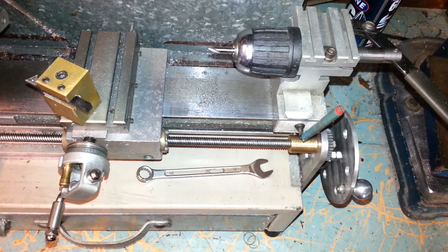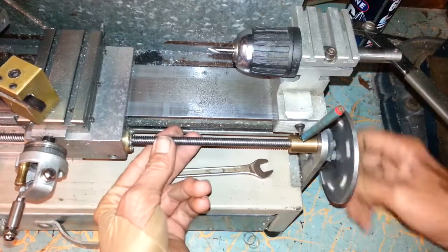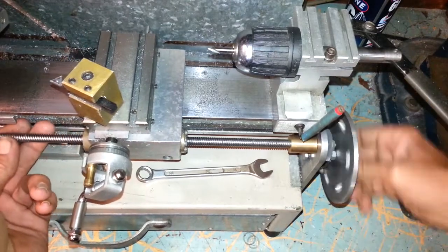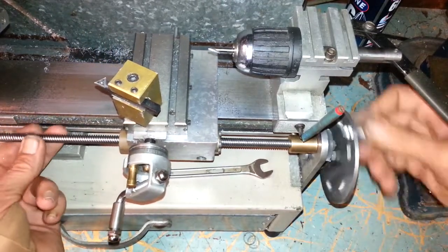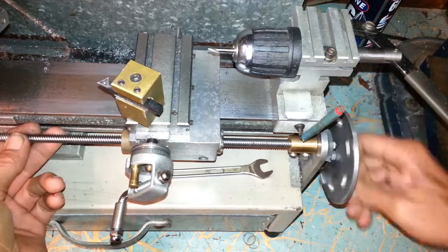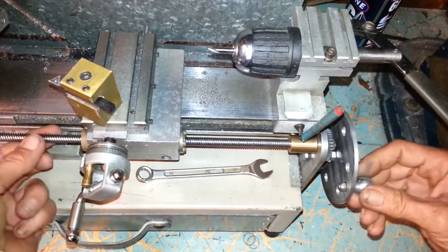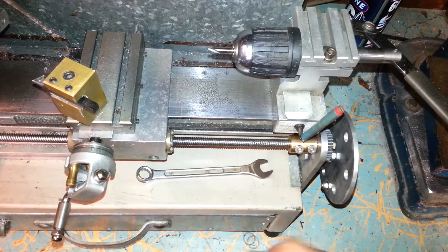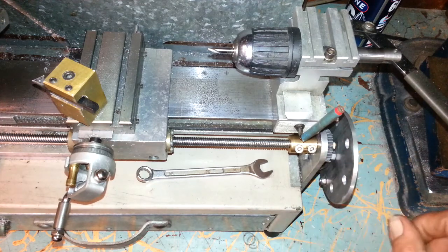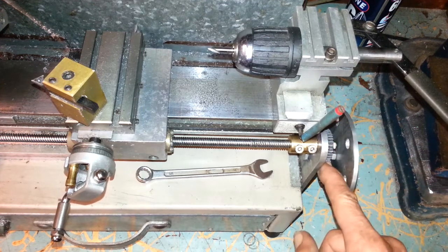The other thing as well, you may notice I've now got a drive on my carriage. I've got a lead screw. This lead screw is off a 3D printer. It's an eight mil thread, it's a four-start thread. It's a right-hand thread. First I thought they were left - big boo-boo. Because of that, you actually have to go down here, and I've got an idler gear that drops it down in direction, but also drops it down in speed.